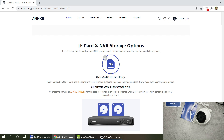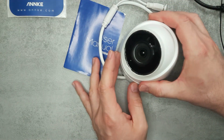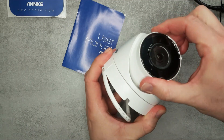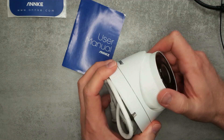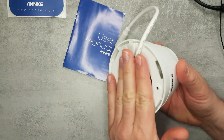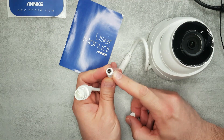For recording, you can purchase a separate NVR to record footage centrally, or there's a built-in memory slot for an SD card for local recordings. Looking at the camera itself: this is the turret model with a plastic base that rotates freely on two axes. The actual camera part is metal. There's an opening for the SD card, and on the underside you have a network cable and a separate power cable jack for 12V.